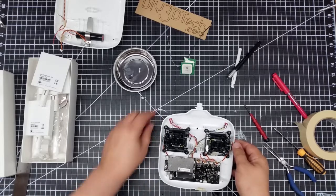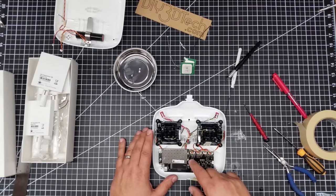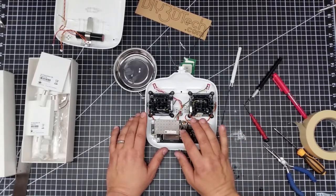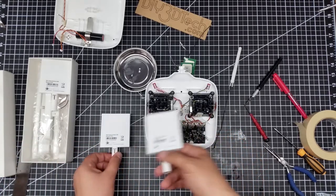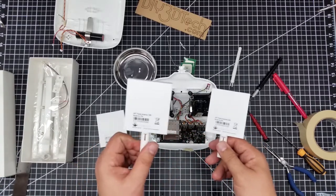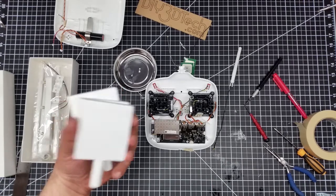So now we've removed the antenna assemblies. We have our control plane down here and our receive antenna here — and you can even see it's marked 2.4 GHz on the board for the receivers. A couple things to note on your panel antennas: you'll have two 7dBi panel antennas and one 6dBi panel antenna. So the 5.8 GHz is 6dBi and the 2.4 GHz are 7dBi. I'm going to run with an omnidirectional for the control plane and these panels for the video.